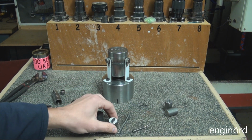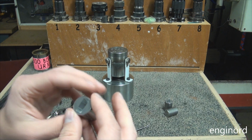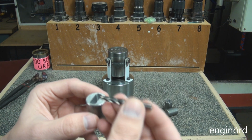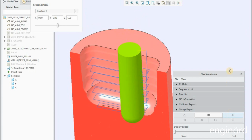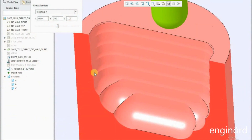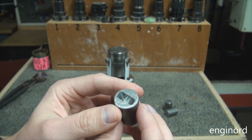So what I ended up doing is I took the cavity that I'm striving for, this forged cavity, I took that shape, and I basically offset the machining 0.4 millimeters, and I came in with a 5 millimeter end mill, and with the end mill, now I can create that pocket. And if you look inside, you can see how the end mill created these ridges inside. So after the machining, there are some artifacts of the machining left behind. So that's the design that I have right now, and this is what I'm gonna test.